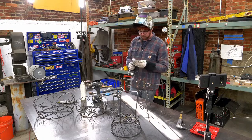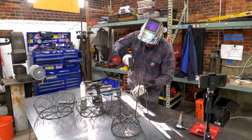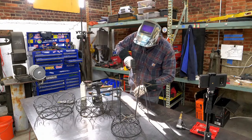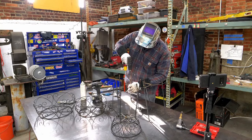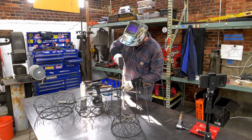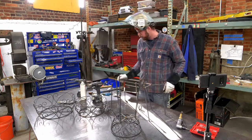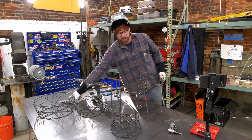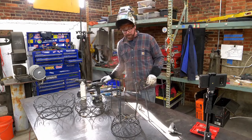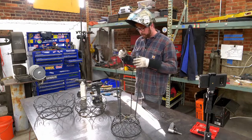So I'm gonna use a 5/16 drill bit, put it in a drill and get down in these holes, because the set screw is still poking in there a little bit. And this kind of gets rid of that. Because the way this worked before is there is a set screw that once you push the first leg down into this bottom leg, you tighten the set screw and it pushes on it. So now we've done away with that system.